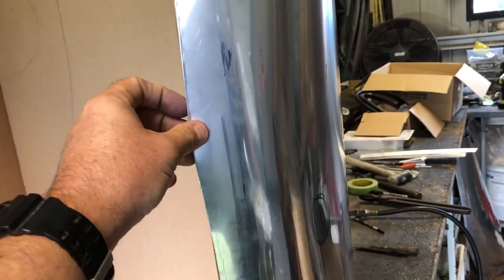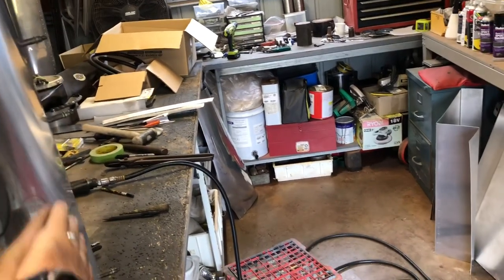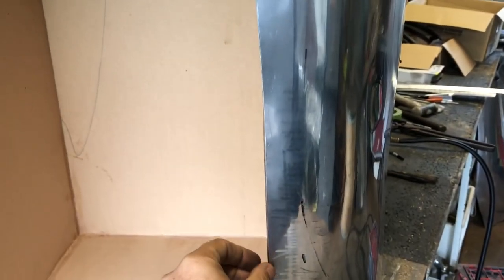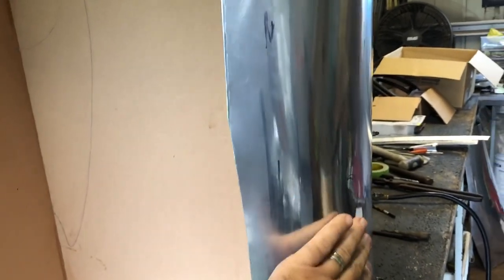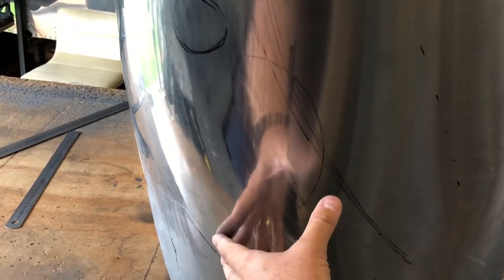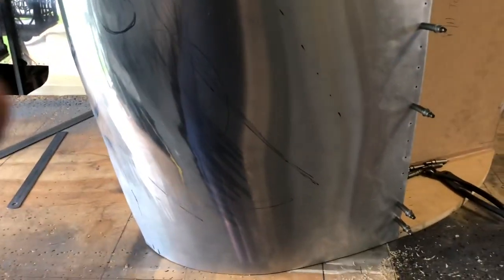There's a very slight dish but we'll leave that for now because I think it's time to start trimming it. Like I said before, sometimes the edges start interfering but you can't start cutting it all away until you know where the panel's going to sit. We're not going to change it too much more from there. So now I can start trimming this edge back so it won't start interfering, and we can almost start putting holes in it. I'll trim this back and then we can start working on this edge and this curve down here, making that sit sweet. But that's starting to look like what I wanted — it follows this shape here around but it's not as severe in that one spot like a big blister; it's a bit more gradual.